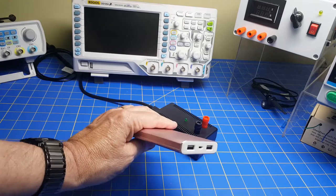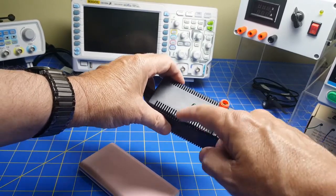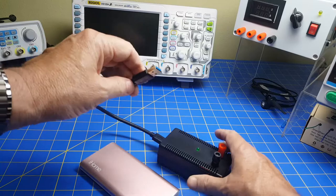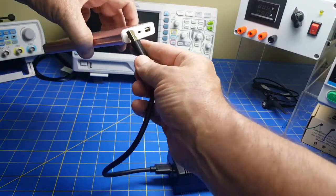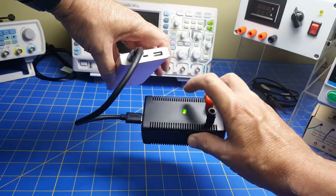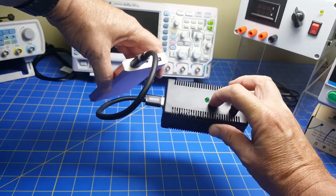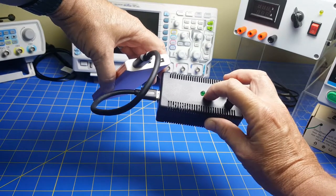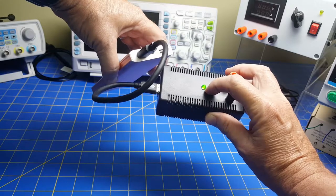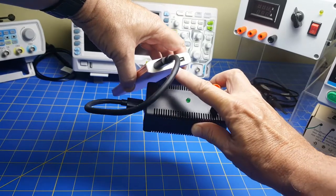I came up with this little device here. It's got an LED that goes on whenever it's drawing power, and it's got two 5 volt DC outputs and a USB input. When plugged in, this light comes on showing it's drawing power. These lights show it's providing power, then it shuts off for about 15 seconds while timing out, and comes on again for about 5-6 seconds to fake the battery, repeating every 15 seconds.